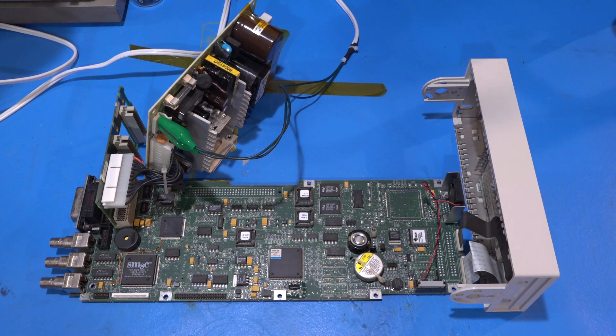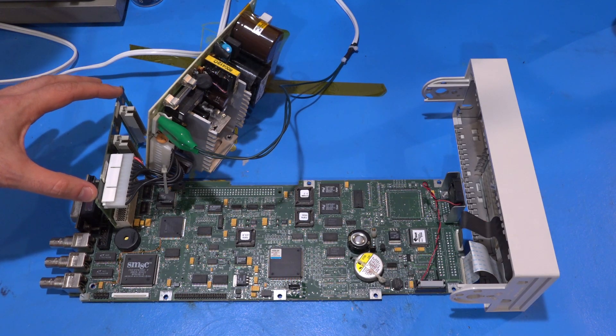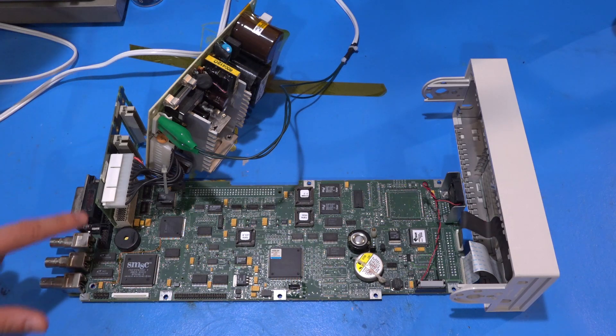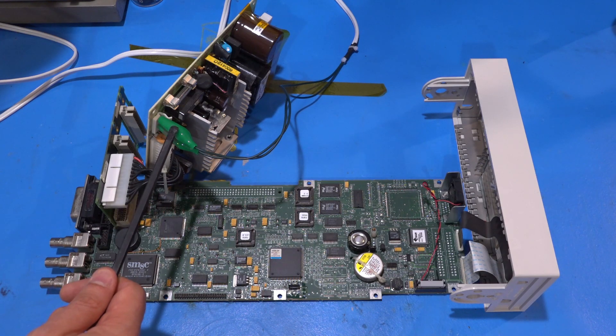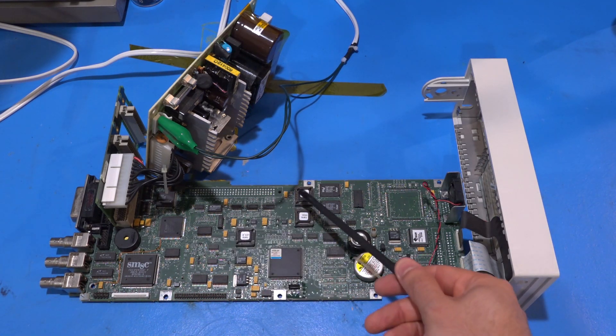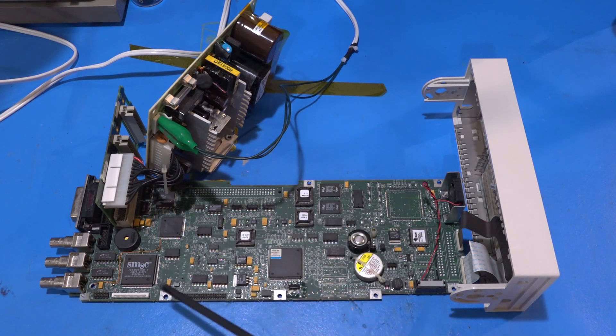Here's my new setup. I had to remove that interface port from the instrument — this is where the backs of those modules plug in from the front panel, carrying power and everything. The AC line is coming from the isolation transformer. The reason I did this is so we can probe everything — see the interaction between the processor and the firmware, and check the power supplies on this board. According to the manual, you hold a few buttons on the front panel and wait for a beep when booting. The buzzer is here on the board, not inside the front panel, so as long as we don't hear anything, something is definitely wrong.